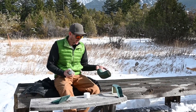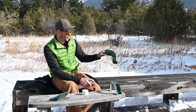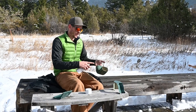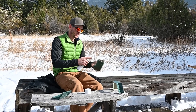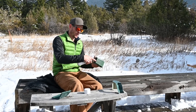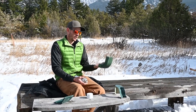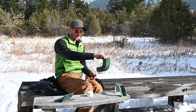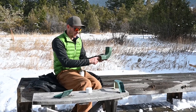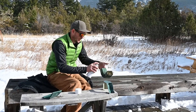Always make sure to shake the can some more between coats or parts. For elbows, I put my hand in the crimped end to protect the inside, and I spray towards the metal on all sides. That way you don't have a bunch of spray paint marks on the inside — if this were the open end facing down, you wouldn't want spray paint marks visible on the inside, it just looks tacky.